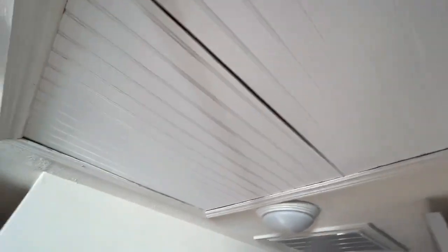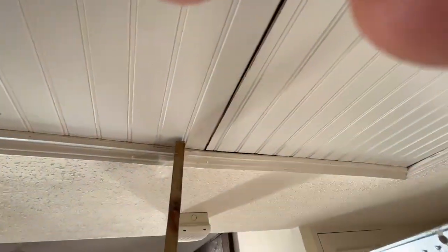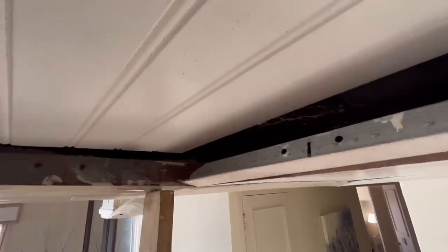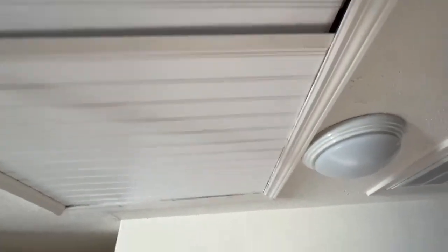We've got both boards up there. We've got to put the middle piece in. Basically how you do this is you put it in this way — you see how this slides. It gives it just enough so it can slide down, and that's what that little quarter inch does; it allows it to just sit on the threshold. Once you get these balanced out, this little gap is what you'll have right here, and that's what this little piece is for. So you lift this up and just put this piece in — finagle it in there, match it flush, and that's it.